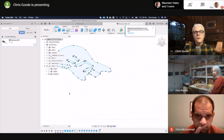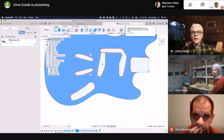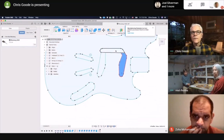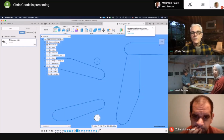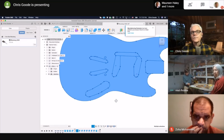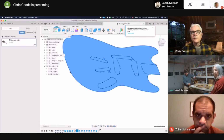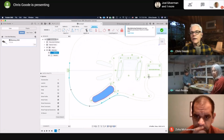All right. So one of the differences here is that it's not green, but the other one is that you can select these very large swaths of stuff here. You see how that all gets filled in? So what I want to do right now is select everything. If we had time, we'd connect all the dots, make a completely enclosed thing. The reason we're not able to select those things in the sketch we're working on is they're not completely enclosed. We've got gaps in it, like the one that we zoomed on here earlier.